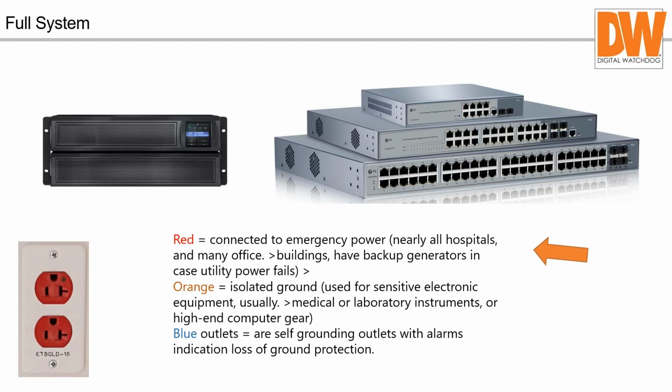Now, I put this here because this time of year in the Southeast, we get a lot of lightning storms and a lot of calls in to tech support because things are going on. And I want to talk about this because the UPS is as important as any other component. It will power the system and make sure it's recording, but it'll also protect it electrically. So a good quality UPS is something that's line interactive and what's called true sine wave. So it's a nice smooth, I'm running my hand up and down like an ocean wave, but it's a nice smooth power going to all the components, whether they're CAS cameras, whether they're regular cameras, whether it's the server, whether it's the switches or whatever.